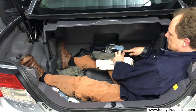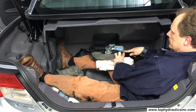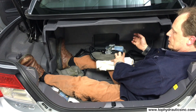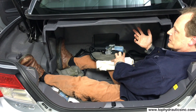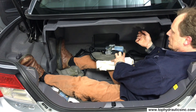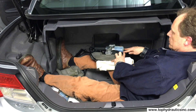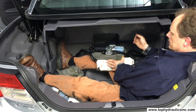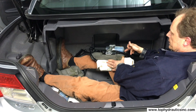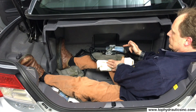The reason we still see the dark line and it's not moving is sludge from the old fluid in this system. Sludge develops mostly from decaying seals inside the hydraulic cylinders, where microparticles get suspended in the fluid and turn into something dark and sludgy. It's a good idea after the car is maybe 10 years old to siphon or dump most of the old fluid out and refill it with new fluid.